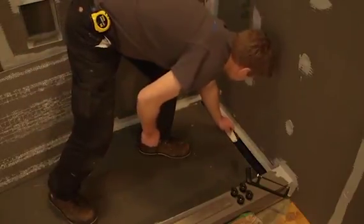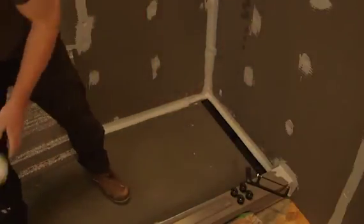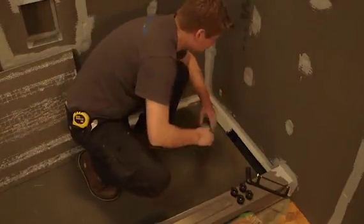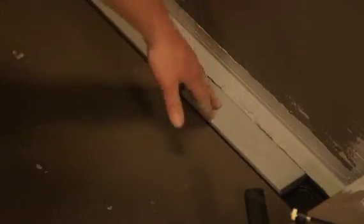We're now installing one of the 3 drain covers available for Fundo Rialito. It's important that the cover will be adjusted to match the tile surface or sit slightly below the tile surface. A dry fit of the tile plus the thickness of a compressed thinset mortar bed under the tile will be the height we are considering here.